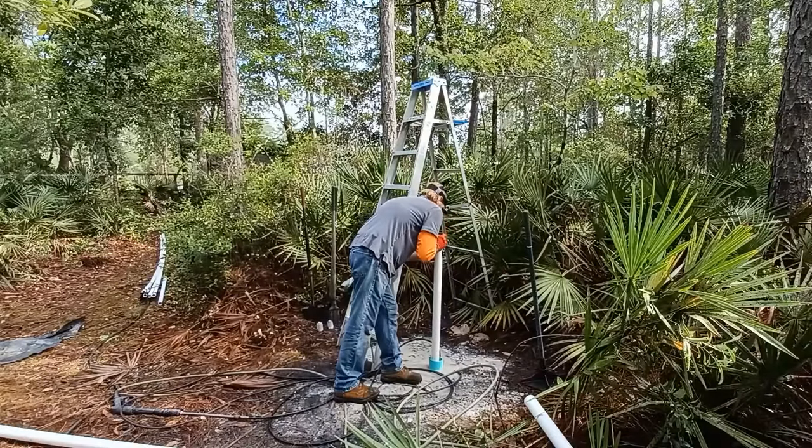But you know what? This was the fastest I've ever drilled a well. And that is using that mud pump and reducing from 2 inch to 1 inch. And you saw how fast that just dug right down through there. No problem at all. If this was clay, I think it would be the same thing. I put the teeth on the bottom of that pipe. Where is it? That's way over there. But it worked really good.